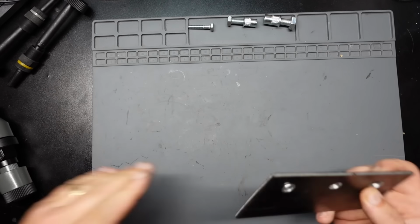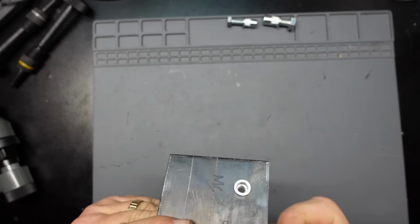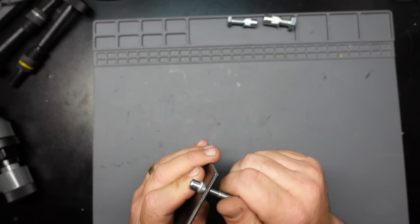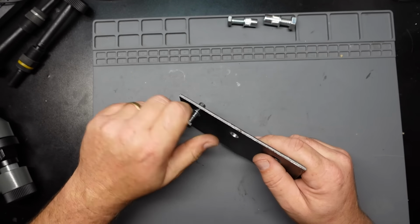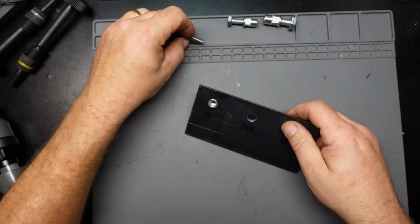And yeah, not bad at all. Kind of went a little offset. Again, I'm doing it on camera, so you've got to give me a little bit of leeway here. But yeah, there you go. Now you have an M6 bolt that you could screw into a piece of sheet metal. Let's try the next size, which would be an M8.